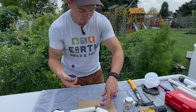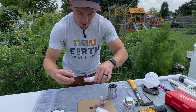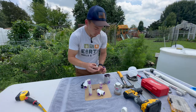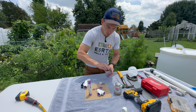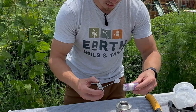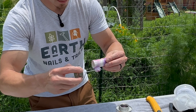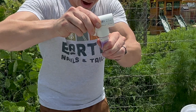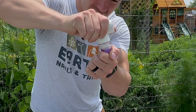On every single one of your connections, you're going to rub this primer on the inside where those fittings are going to be made up, as well as around the PVC pieces. You could fit your finger in there to not touch it, or you can wear gloves — that'll probably be the smarter option because this stuff can stain even your skin. So I'm just going to work my way through all of these connections, making sure I get everything nice and cleaned and ready to go, even inside of the valve. Once we're done with our primer, it's going to dry very quickly. Then we're going to get our cement — this stuff dries even quicker. The process is the same: rub the cement around the PVC piece, immediately grab your connection piece, stick it in there and press. After a few seconds, that's rock solid — you can barely twist it anymore.